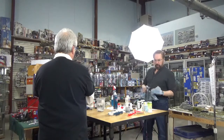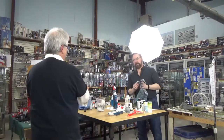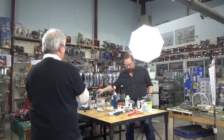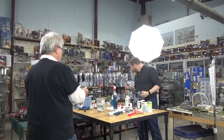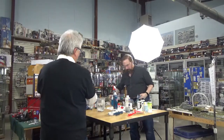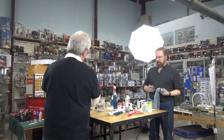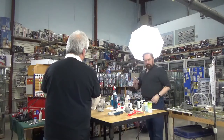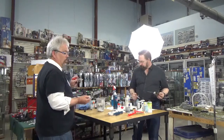I think this is candy silver, we call it. If we have time, we may put a clear coat over that to show you what it can do as a base itself. So in this case, I put a black base, I'm spraying on my shiny aluminum. Now, as you can see here, I also put it over plain white plastic. See how it doesn't pop as well as it did over the black? I don't know if it shows on there, but it really doesn't pop. The black gives it a back reflection, which really sets it off. And in the case of the chrome, it starts to pop it. There, I just made a metallic truck body at least.